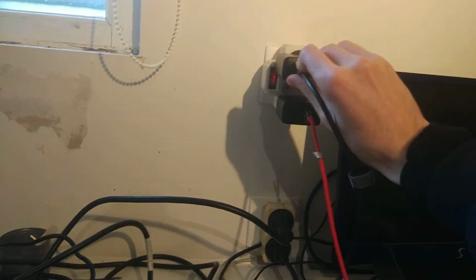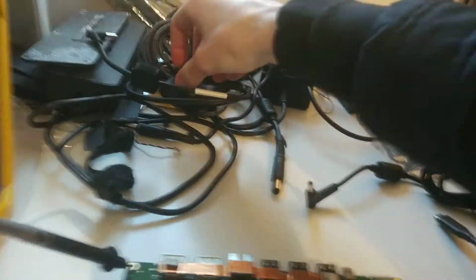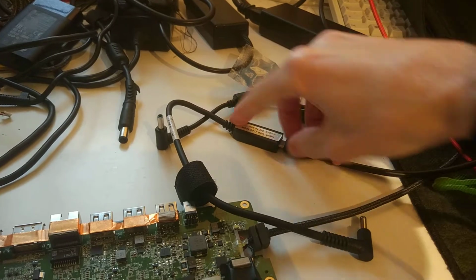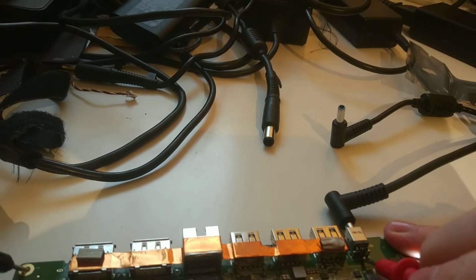So what we can try is to power with only 11 volts. And sorry, I'm gonna use my 2 hands. So again, not charging. And I'm gonna apply voltage on the metal pin. Up. Light is going on. And then the laptop's charging.